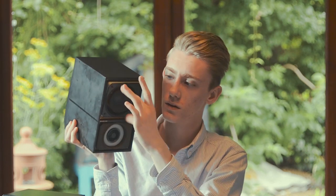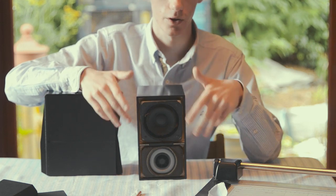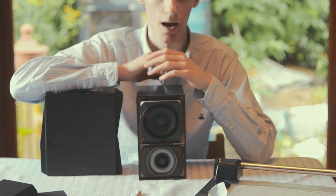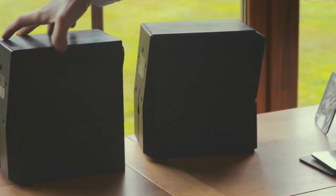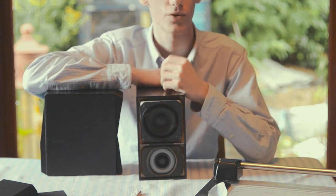I've cleaned it up as much as I can and I'm just going to stick on some new replacement surrounds, which are four inches in diameter. The specification of these speakers is only 60 watts and I've had to listen to them very quietly because I didn't want to damage the woofer. I was very taken aback by the sound because I'm used to bassy but muddy sounding Wharfedale speakers. When I listened to these they almost sounded tinny, but then I worked out it wasn't tinny - it was just extremely clear. I think the silk tweeters are really something quite amazing, and the sound had a really present mid-range.